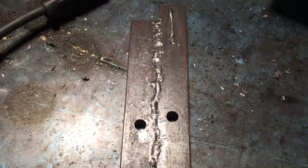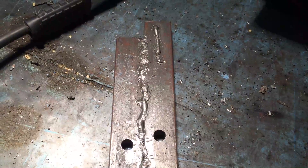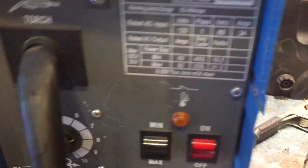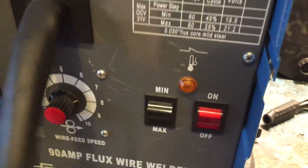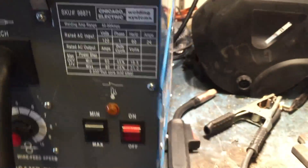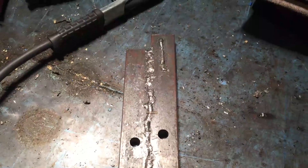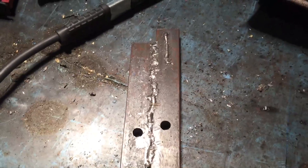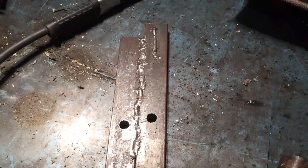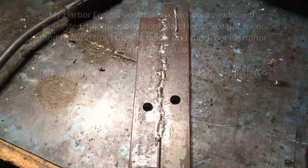What turning this thing into a DC welder and just using Harbor Freight crappy wire feed is doing — I'm really surprised. That was on max power and feed was about 7, 7.3, right in there. Very pleased with how strong this is and how well this welder is working. Definitely worth the thirty dollars or so to get it upgraded. Go check out the mod — the link is below — and see if you think it's worth it. I think it is.